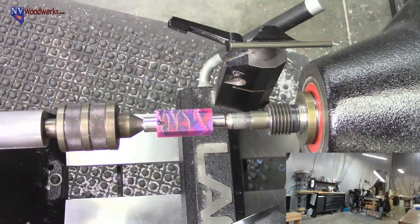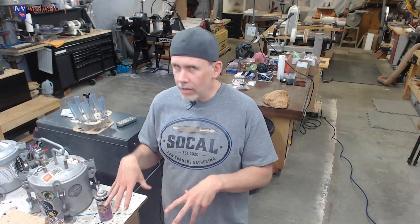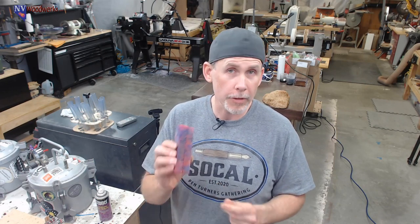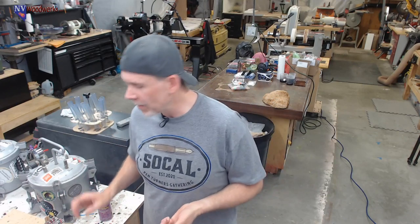So let me switch camera views real quick to the lathe. There's the cap part ready to go on the lathe. Now, one of the things that I wanted to mention, I think we can get through these fine, but I wasn't able to wash off the surfaces of these, and resin and metal don't necessarily stick together too well unless you scuff it up or make sure that it's totally clean. So it may blow up on me. I'll probably wear a face mask on this one.